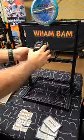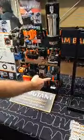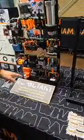You can either throw on a replacement if you have a jam, or change completely the hot end. So I could put a cake extruder. This is an acid resist pen for making PCBs or metal engravings, ceramic printer, other direct drive hot ends, laser cutter, high power laser, a marker pen. We did t-shirts where we did multicolored marker pens, and then we put on a hot end and did TPU details over the top, all on the same machine, right? Dial gauge, vinyl cutters, a little bit of everything.